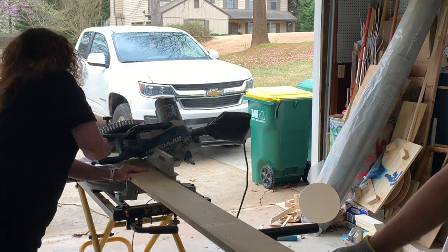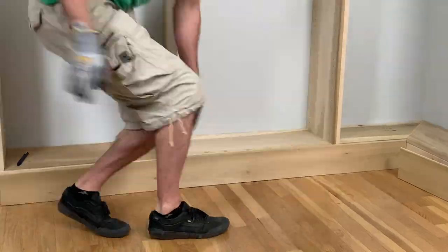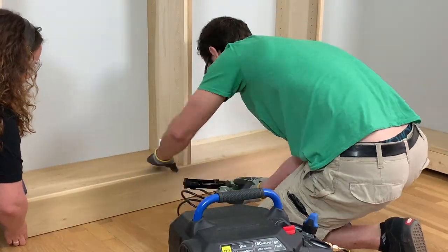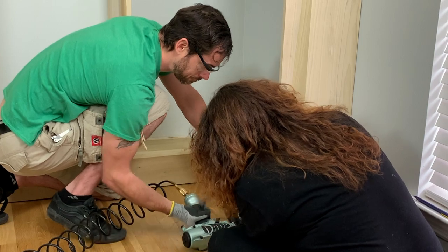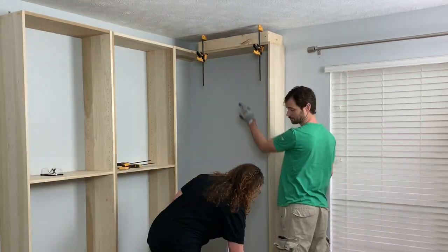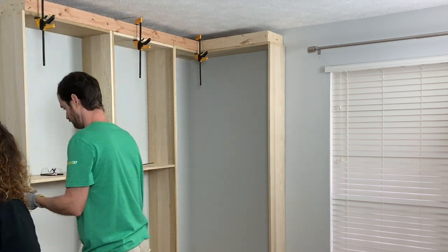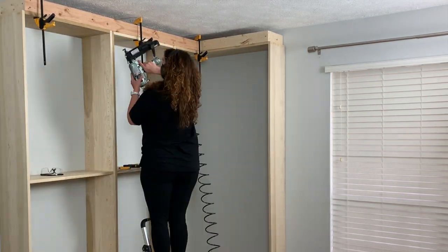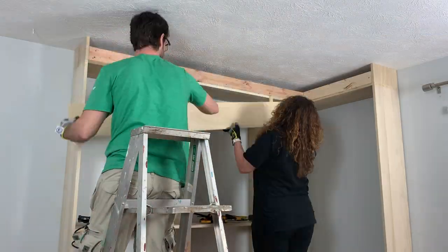For the facing, we cut a 45 first, took it inside, lined it up on the bottom of the unit, and drew a line. We then cut it to size. We do this with every piece of facing for the top and bottom because we didn't want to rely on measuring tape — we wanted to measure exactly in place with the unit. We used a 1x6 on the bottom, and on the top we put a 2x4 frame on top of the unit so we could nail our 1x8 to something solid. We then added small cuts of the 1x12 flush on the sides, and a 1x8 on the front, which gave us a little overhang at the top, joining at 45 degrees and nailing into place.